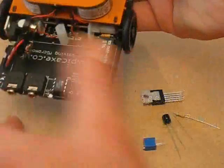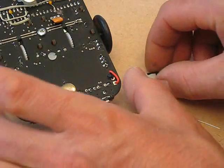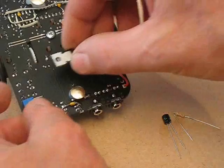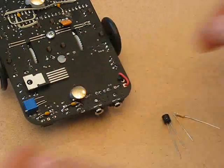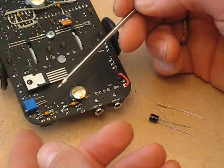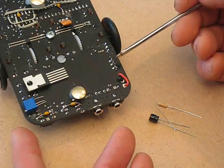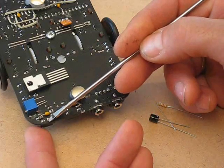The original five-volt regulator is supplying the power to the motor driver chips, but we're going to add in an additional regulator with a variable voltage taken directly from the battery. It's a very simple circuit with only four components. I'm going to fix the variable regulator there, and a pot there so that we can turn it with a screwdriver to vary the voltage. We're also going to drill out this little square wire that connects the original supply to the motor driver chips, and add a wire from the centre pin of the on-off switch through the regulator to that square wire.